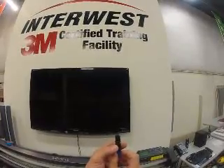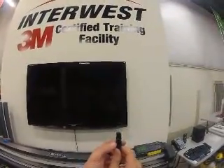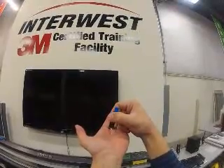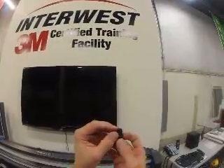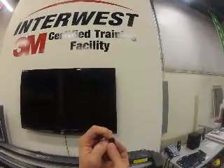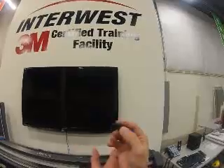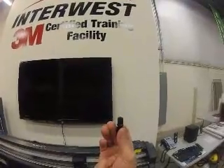The whole idea is you don't want your blade out too far. The way that plotters work, you're actually cutting not only on the depth of your blade, but the downward force pushing on the material, and the actual speed the material is running through the plotter. If you have too much of your blade sticking through, when it punctures and penetrates the actual material, you want the tip of this black ABS to be riding on the material almost to make smooth cuts.